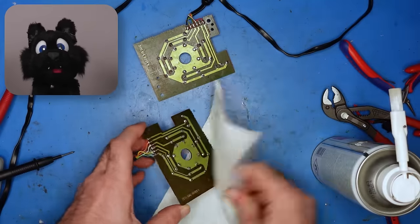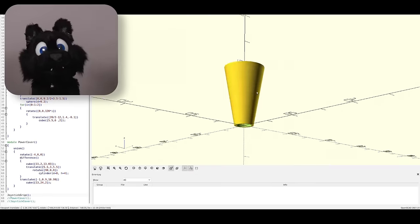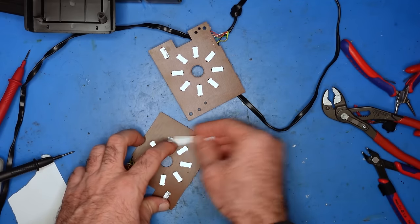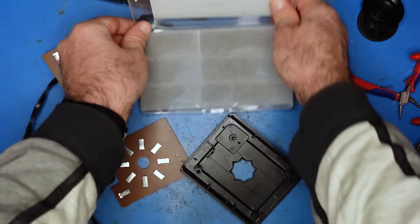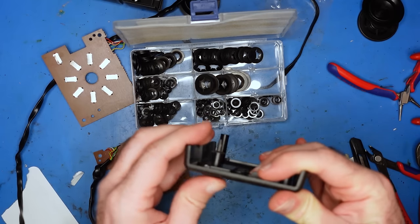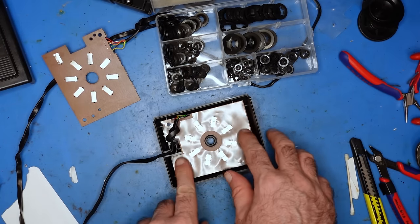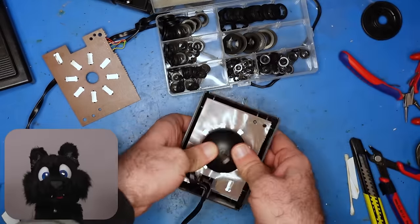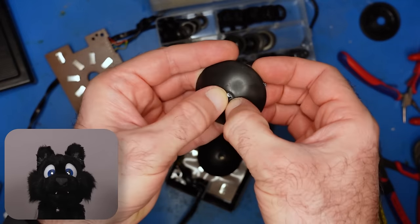Now to assembling the joysticks again. The missing cover plate was not the only problem — pictures show that the sticks originally had some black handles on them. And to top things off, my StarLock washer set is ever so slightly different than the original, so I needed to add about half a millimeter diameter in the recessed area of the stick cover to make it fit.